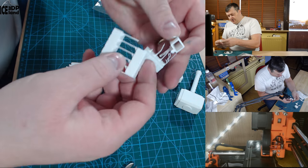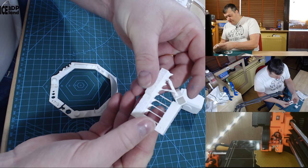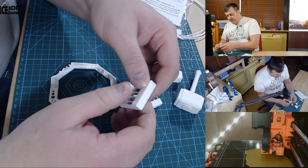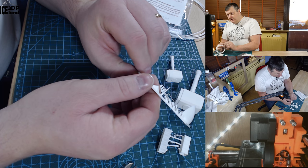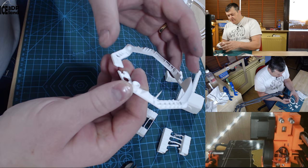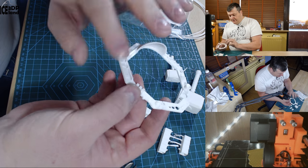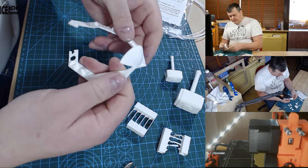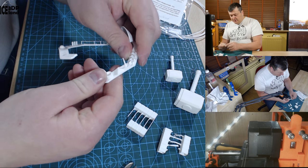I printed a temperature tower test from 210 degrees down to 170 degrees. I broke it in half to see how strong it is — it was very difficult to break apart. I then printed this test piece and the overhangs came out really good. There were no issues with the steepest overhang — it is perfect. The column is very good and the bridging was very clean. Just everything about this print was spot on — a very clean print. It bends a little bit more than normal PLA, which gives it a good strength character.